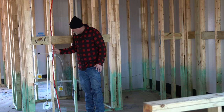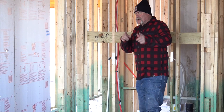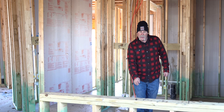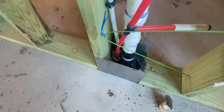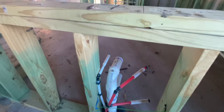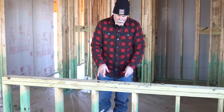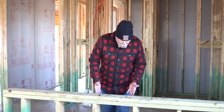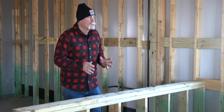Remember the ice maker line I told you about — here's where the water lines come down. You've got your hot and cold coming down, again half-inch lines. You're catching an ice maker but also a kitchen sink. The ice maker branches off right here, and your hot and cold loop around underneath the slab and come right up over here. You've got your drain, your vent, your clean out, your hot and cold — hot branches off to the kitchen sink and dishwasher, cold catches the ice maker. I'd like to see three-quarter, but other than that everything hit the wall. This is a good-looking rough.